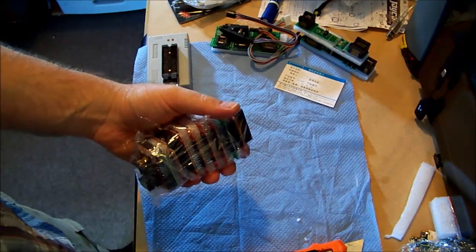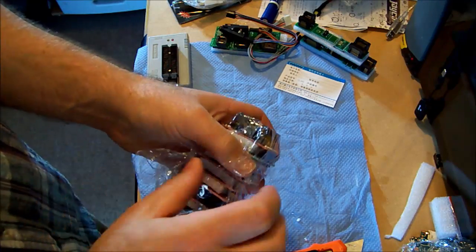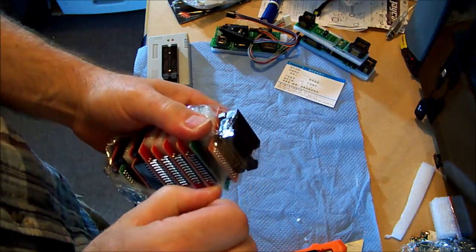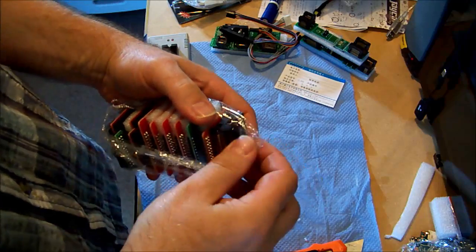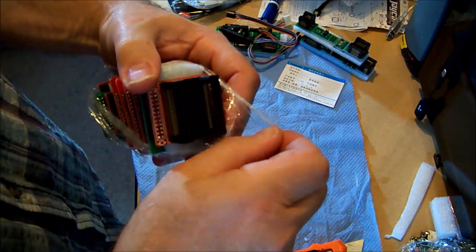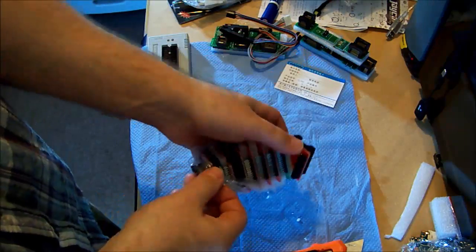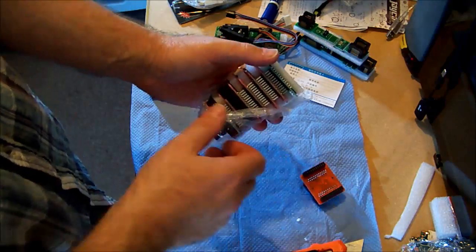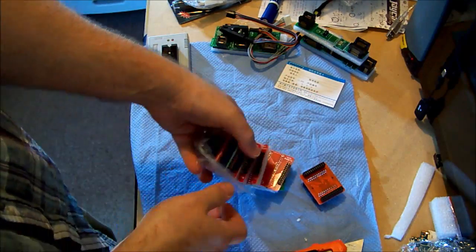Now, the wireless dongle, so to speak, has stopped working. It won't boot unless the NAND flash chip is frozen. You've got to hit it with a freeze spray and then it boots. So what I'm hoping to do is, under frozen conditions, read out the contents of it and write it to a good chip.